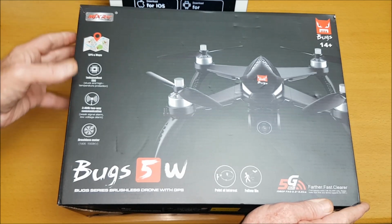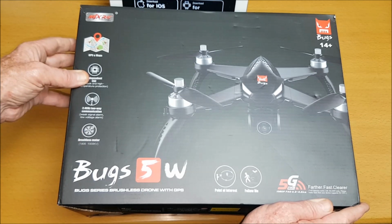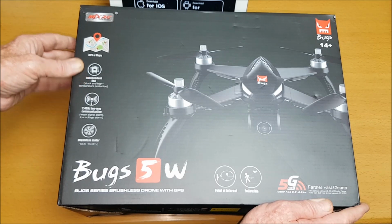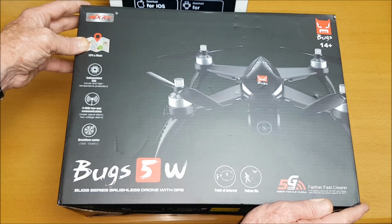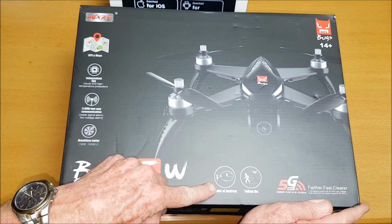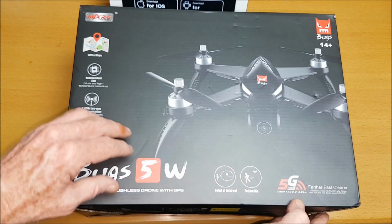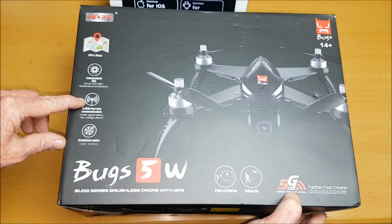Now this has brushless 1806 1500 kV motors with independent ESCs. And with the confidence of having GPS, it's also got waypoint navigation using GPS and maps. Can do a rotation of a point of interest, and also has follow me. Now the Wi-Fi works on 5G and the radio control transmitter on 2.4 gigahertz.